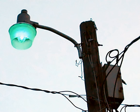Topic: Usage of low-pressure lamps for surface cleaning. Low-pressure mercury vapor lamps usually have a quartz bulb in order to allow the transmission of short wavelength light. If synthetic quartz is used, then the transparency of the quartz is increased further and an emission line at 185 nanometers is observed also. Such a lamp can then be used for the cleaning or modification of surfaces.